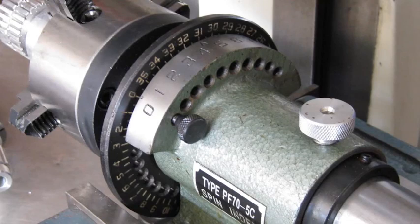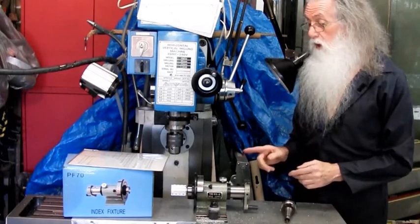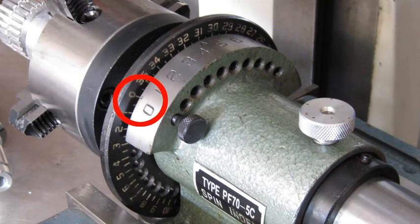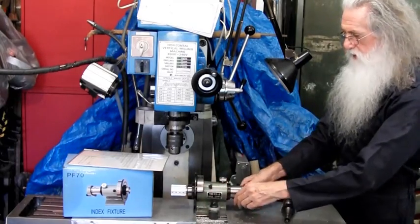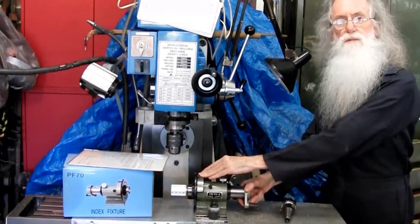They've got a V indicator point up here between the 4 and the 5. Totally useless. Extremely confusing. Waste of time. Why? The zero hole is there. You have here, say, for example, 32. The zero hole is lining up with 1. So as you're operating from there, you're thinking, where am I? And the more the angle you look, is that 32 or is that 31?